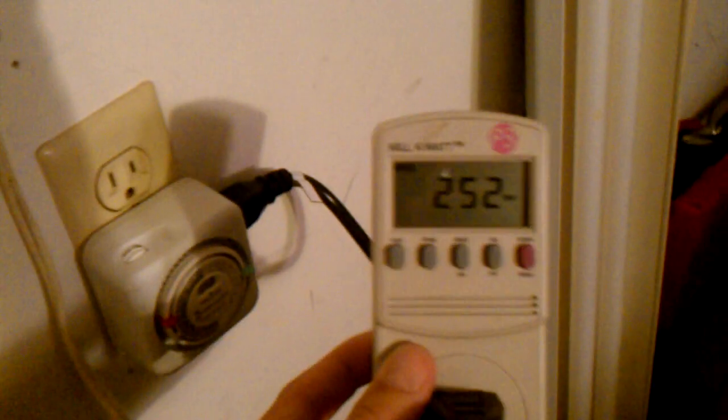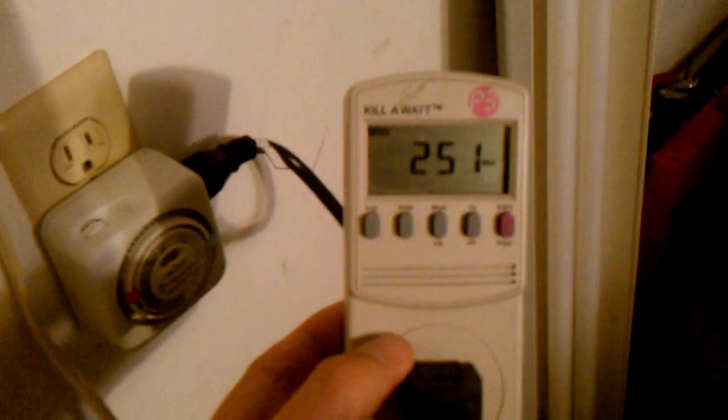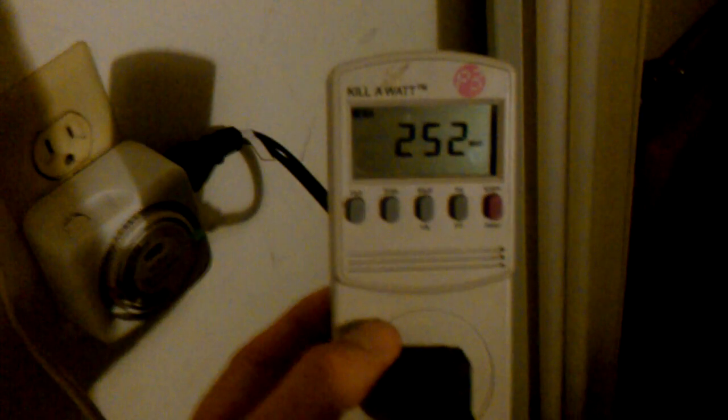Let's just see what we're making here. The solar tracker has enhanced the output quite a bit, even just doing it manually — pointing it directly at the sun has increased the wattage quite a bit. So 350 watts of panels, 24 volts, running in parallel.